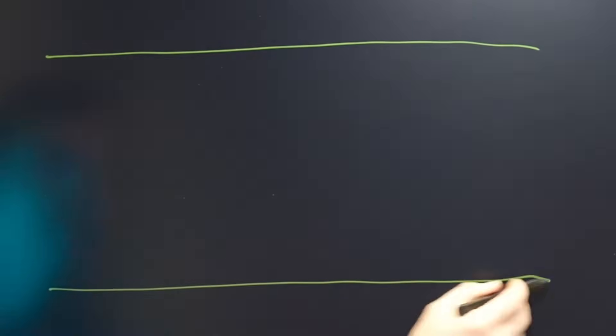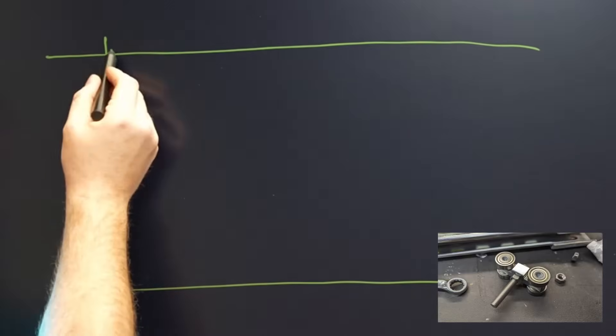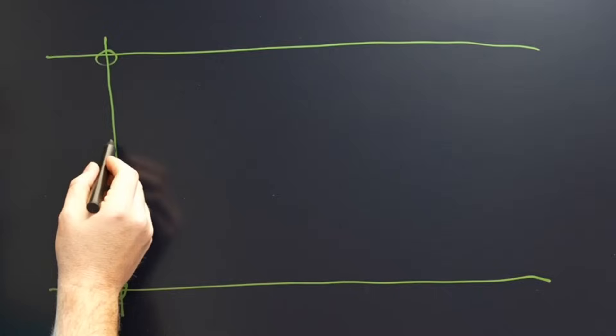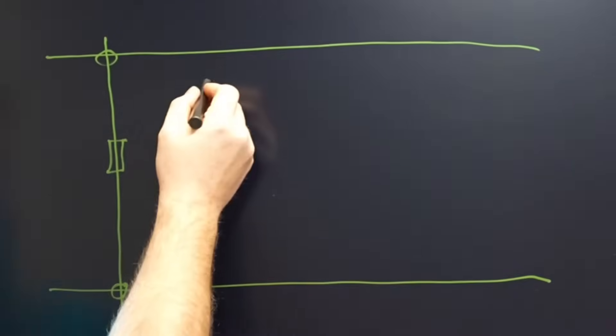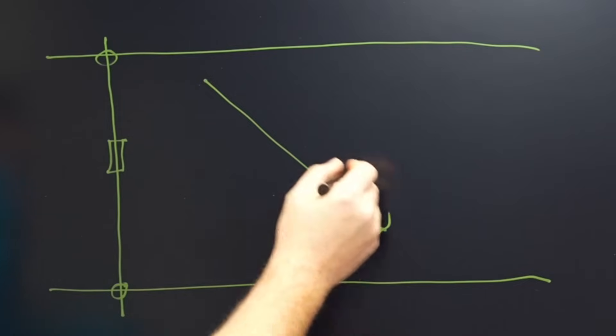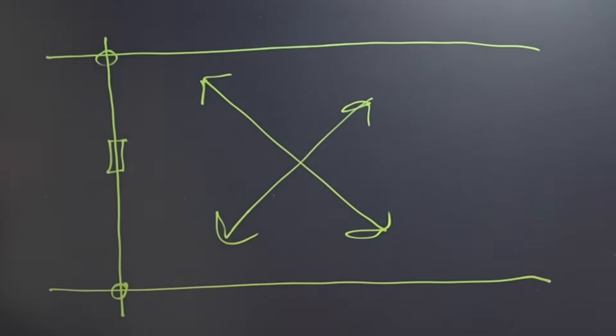After I posted videos of this crane and how I put it together, I had a really smart viewer who posted an idea that has stuck in the corner of my mind for the last three months. His suggestion was rather brilliant. Basically, he said take two tracks and mount them permanently to the ceiling in parallel, then take another track and run it perpendicular. Make sure these are on rollers, and mount your crane right there also on rollers — which would mean you could run this crane anywhere within this track and it should work just fine.